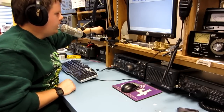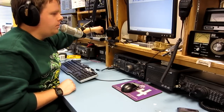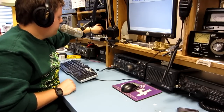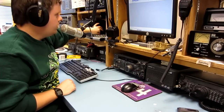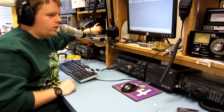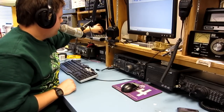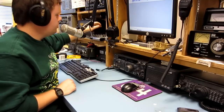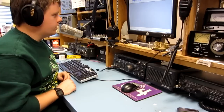Now I'm going to crank up the highs. On most transceivers, you can't really hear this. On single sideband, you can't hear 12 kHz so well. But what you can do is you still can bring it up a little bit, bring up the mids, and bring up the highs, or put down the highs. It depends on your personal preference and what you're wanting to get out of the radio and all that. So we're going to put it back to the middle here. I sound so flat, so I'm going to turn up a little bit of high and a little bit of low. And we're sounding good.